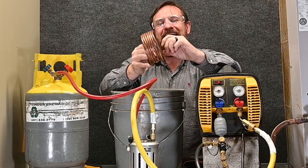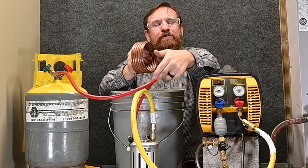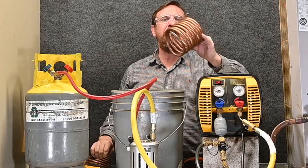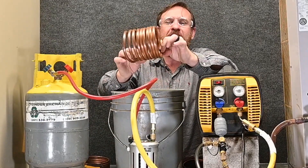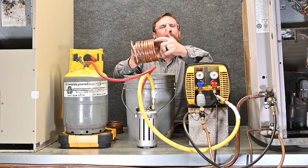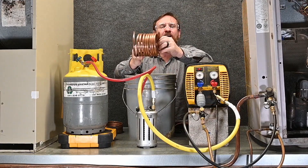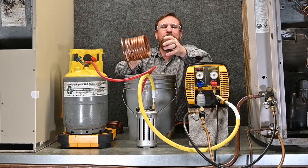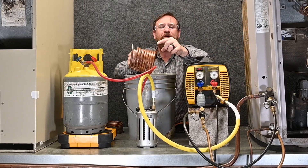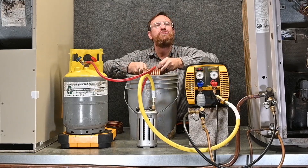An even better option is to increase the size of the tubing. Quarter-inch is going to be a restriction from our pump, and we want to remove all restrictions we possibly can. So I prefer to use 3/8-inch copper. I took 3/8 copper pulled from another job and an old suction line accumulator, wrapped the copper around it, rolled it up into a nice little barrel. All I have to do is add a bit more and braze on service valves with service ports here and here, then attach my hoses and drop it in the bucket.